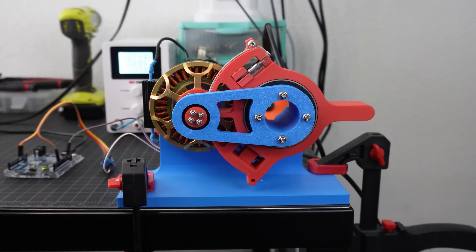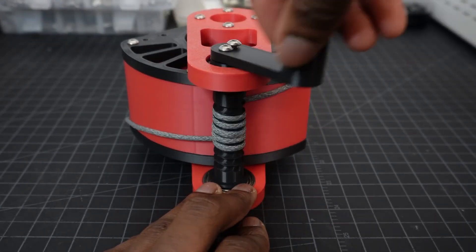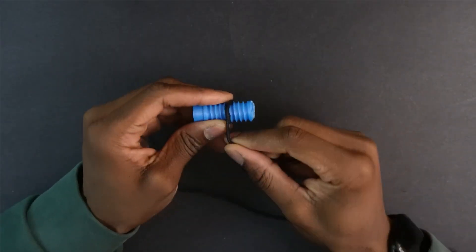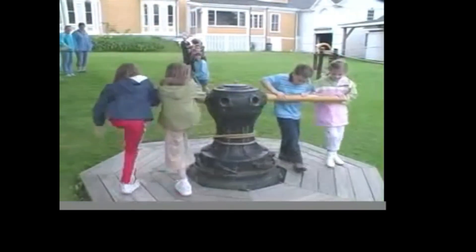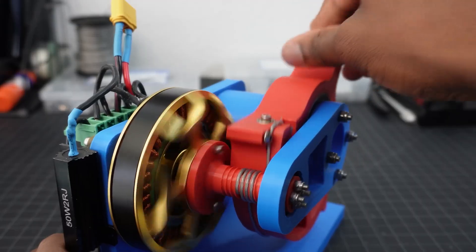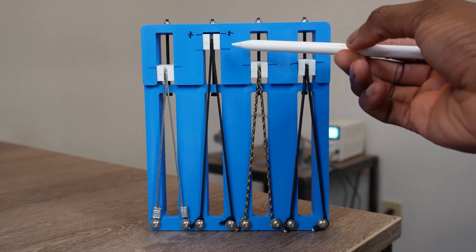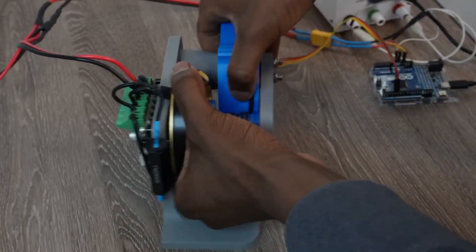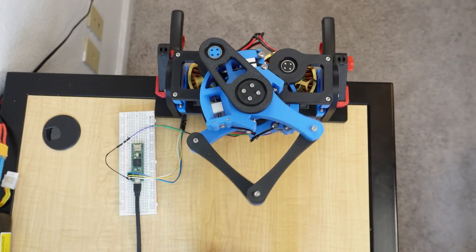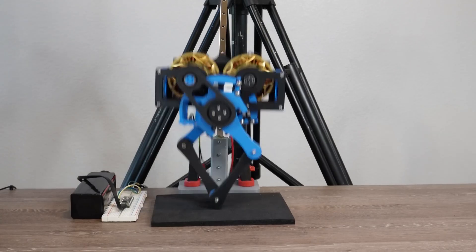Time for some tips and tools. From A&MUSA we have a new robotic speed reducer assembly with no backlash — a capstan mechanism. You may have heard about capstans as a mechanism in audio cassette players, but the term comes from an old sailing ship mechanism for tensioning ropes. He takes his time putting it through its paces, stress testing steel cable, paracord, and a few others before landing on an extension-free rope called DM20. He finishes the video by using a dual capstan drive to create a five-bar linkage, then uses this to draw shapes and even jump.